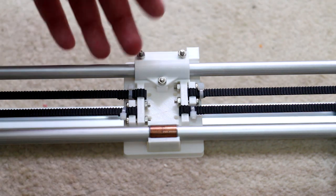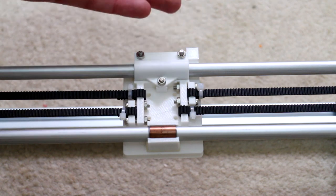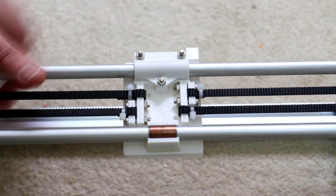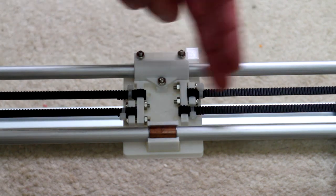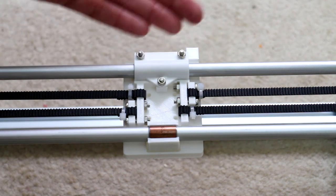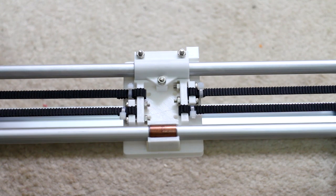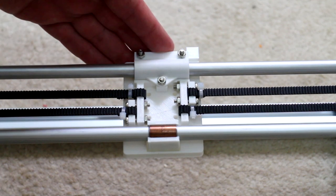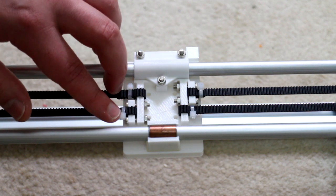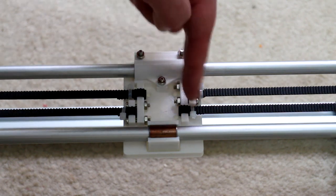But I found that tightening the belts in this way causes the whole X gantry to skew, because I'm tightening on one side first, so it's pulling closer to one motor. Then I'm tightening on the other side, and it's pulling closer to the other motor. And there's no guarantee that the final tightened result will be a perfectly parallel X gantry on the Y axis. So I'm going to redesign this for the next video, where I'll be tightening both of these belts at the same time on one side only, and the other side will just have the belts fixed.